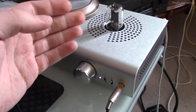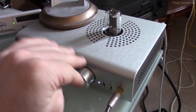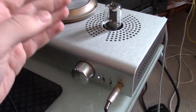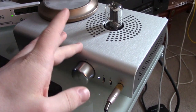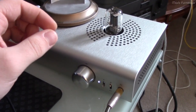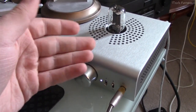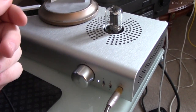I think that ideally it should be lower than that. Obviously there has to be a cutoff at some point, because at some point low frequency AC looks like DC. But I think 8 Hz is a little bit too high. My best guess is this is probably using an RC filter to generate a time delay through an RC time constant, going into some comparator. If they're doing it in an analog fashion, which I suspect, it should be relatively easy to modify those component values. So I'm going to take this apart, show you how to take it apart, and we will see about modifying it.